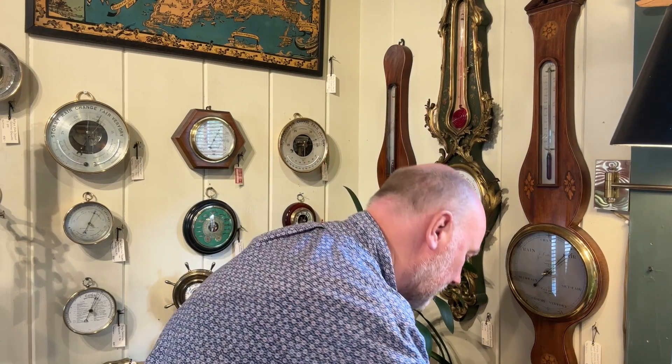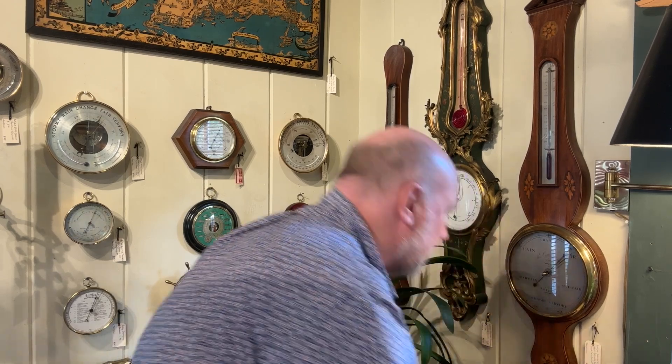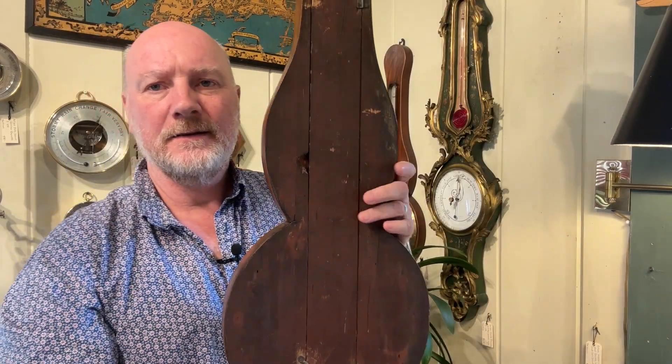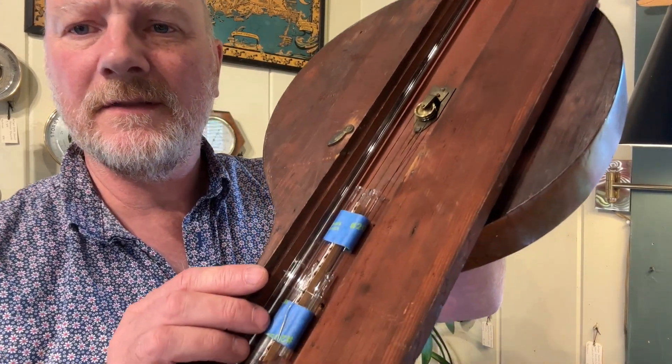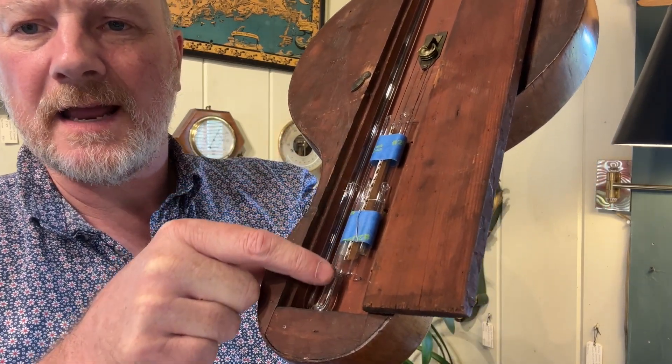I'm going to show you this on a wheel barometer so we can see it a little bit differently. As I'm handling this I'm going very smoothly and finding a good spot for it to lay safely. I'm going to pick up a wheel barometer — slow, steady movements — tilt it onto its side, open up this case, and in here you're going to see a full column of mercury. As I hold this up and down you should be able to see that pumping up and down. If I lay it flat, you hear that click — that means it went all the way to the top. The bottom end where the mercury opens up is open at the top and because it's on an angle it's drawn down as far as possible.